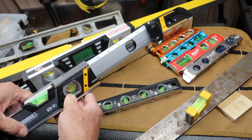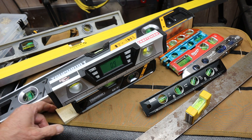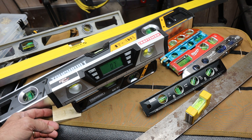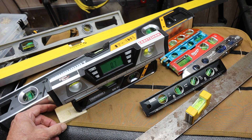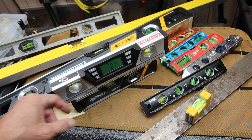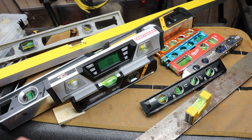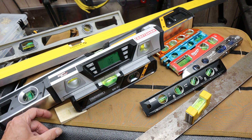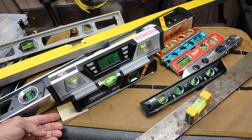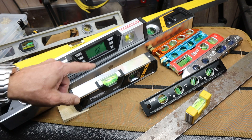I measured this out. What I actually did is lined it up, used a wedge, figured out exactly where zero is. I tried to line this up and calibrated it. I dropped it down — there's zero, or point one. I basically took a close look at what this bubble was doing at zero, and then started ramping up till I hit one of the three lines. To one, it was basically 0.3, 0.6, and then one degree on that full third line. So I kind of calibrated a bubble level.